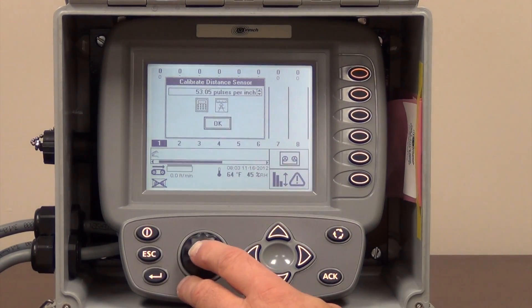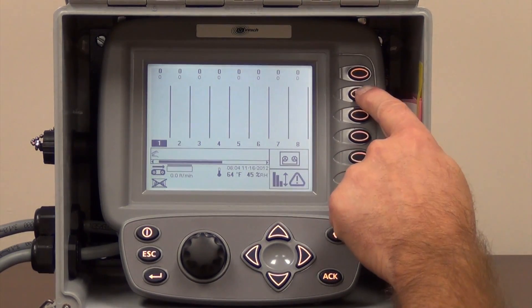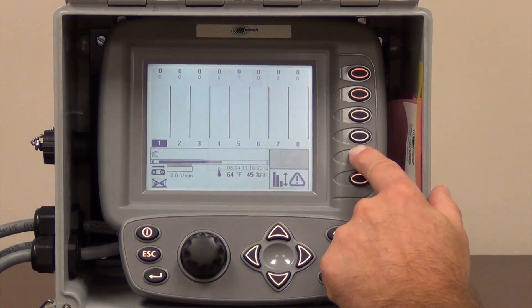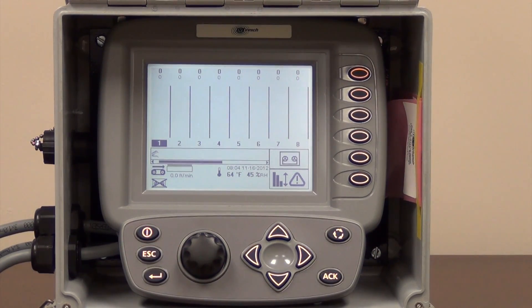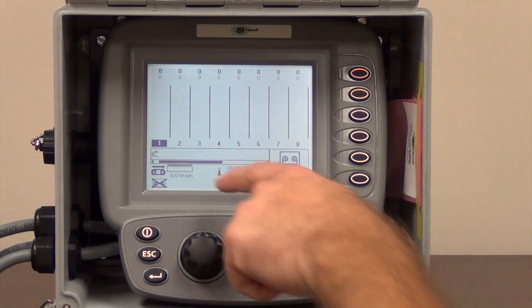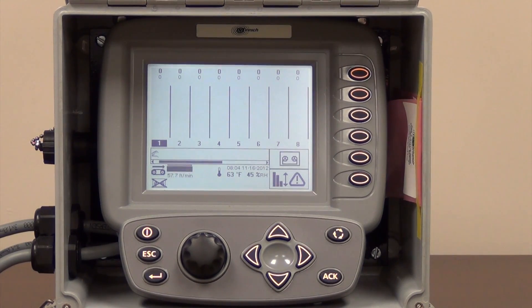To accept that change, we also have to highlight the OK box, accept the changes that we made and enter that. That is about all the functions we have on our paving system and we are ready to go to work. When you have a ground speed wheel on your system and it is turning, it will read out feet per minute down here on your screen — you can see the little bar graph and how many feet per minute you are traveling with your paver. It's just a good reference for the operator to know how fast he's traveling.